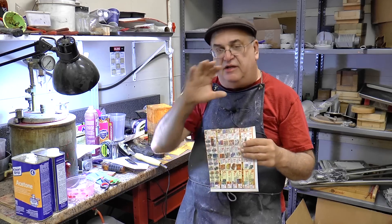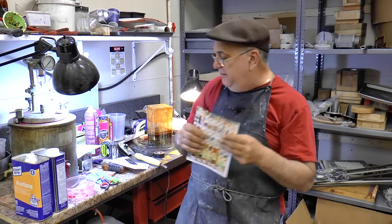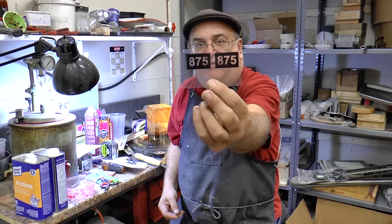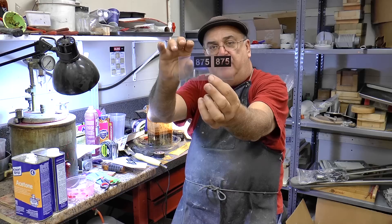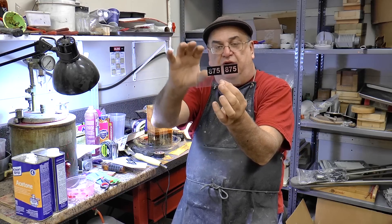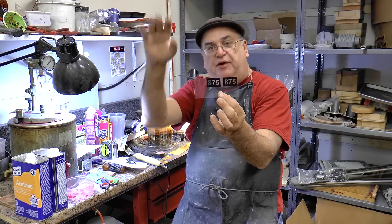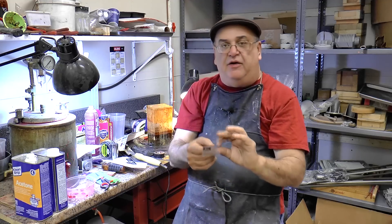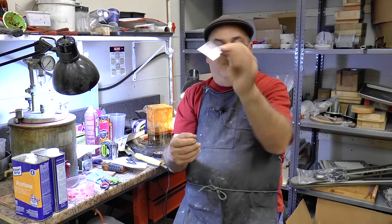The secret is you've got to do artwork on CAD. I use TurboCAD 20. You make the box and put the letters in white. When you click on the box and change it to black, the numbers disappear because they're behind it. So you click on that, go into your program, bring it to front, then make those letters white. It comes out like that — what you would call a negative. This stuff here is transparency film, like you'd use with an overhead projector.